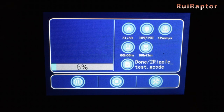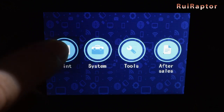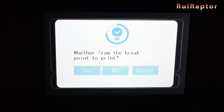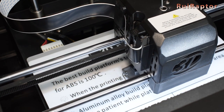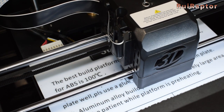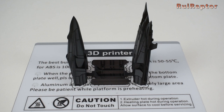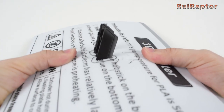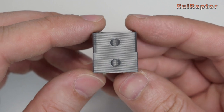This printer also has the print resume feature for when the power fails during printing. If that happens, the printer does not show anything on the screen after power on — we need to go to the print menu, select the same file, and only then it will ask if we want to resume or start from the beginning. When programming an automatic filament change, this printer accepts the command but you need to use the M0 command instead of M600. The magnetic print surface also works very well — it secures parts nicely without the need of a brim, and even small models with almost no base will be printed without any issues.